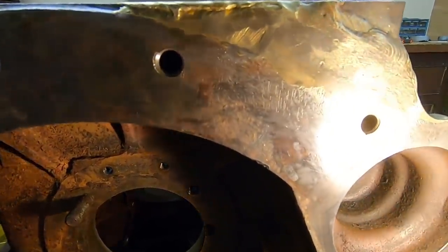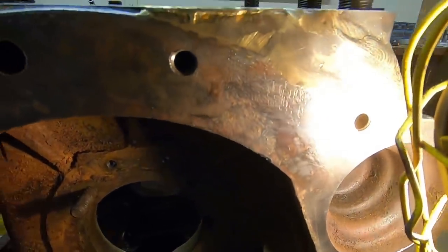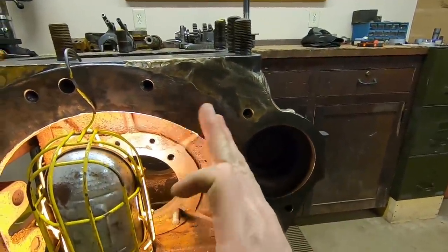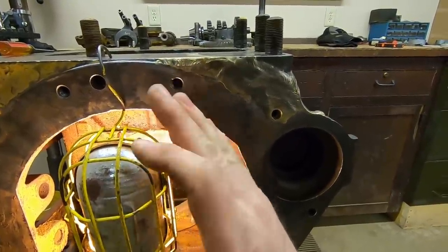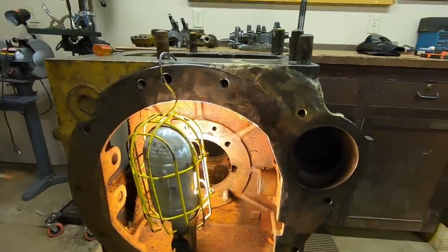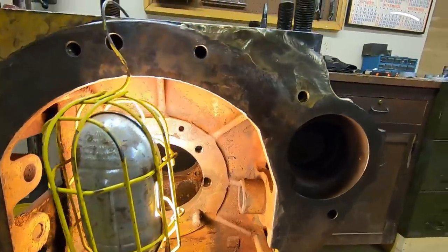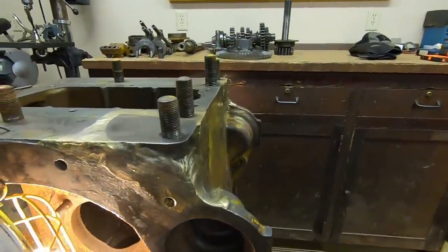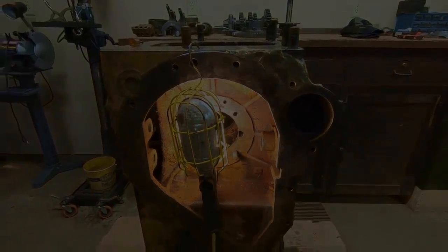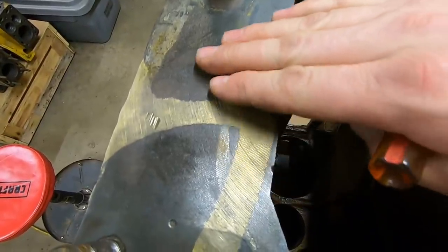You see all those little marks - they look like all kinds of little hash marks all the way through there. I believe that was possibly some sort of chipping hammer, because when you get cast iron hot you want to relieve stresses by just going tink tink tink tink tink all over. You can see them back here, over here, and even on the other side. So evidence of what was for sure a localized repair that - in my mind - they pulled off a heck of a feat by being able to repair that and not make it worse.